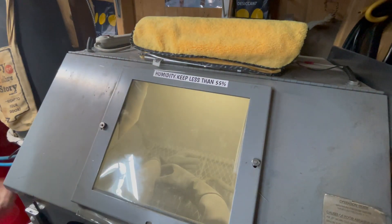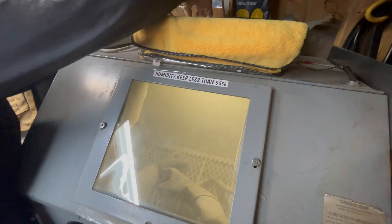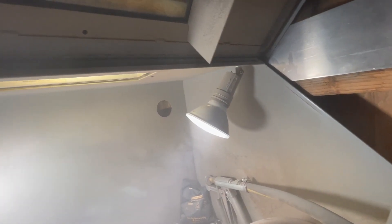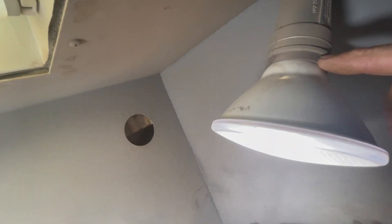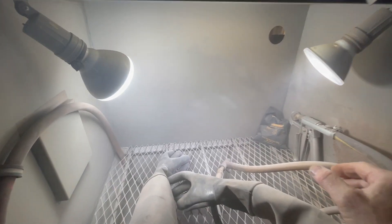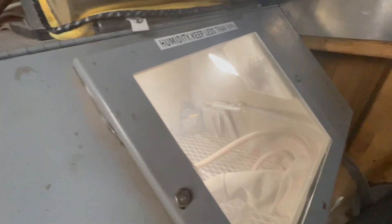So what I did is I put two LED bulbs up here with outlets. There's foam stuffed in around because if the sand gets in there, you can't get the bulbs out — I had to break the last bulb to get it out. I have it set up so the light can go on without turning on the blaster, so you can get your stuff ready, get the ring in there, get the light on, and then turn it on.